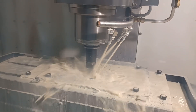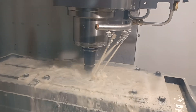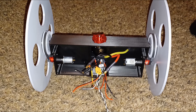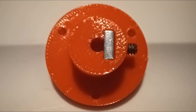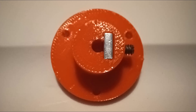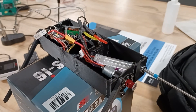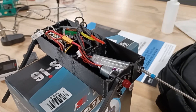The wheels for my robot were machined from 1/8 inch HDPE and measure 7 inches in diameter. These were originally going to be belt driven, but after running into weight issues, I decided to just have them connected straight to the drive motors. To lessen the stress on those motors from impacts to the wheels, I 3D printed some flexible TPU hubs with a slot for a square nut that holds a set screw. All other plastic parts — the frame, legs, and wheel rods — were 3D printed out of nylon.